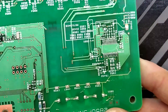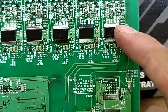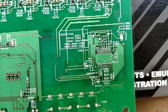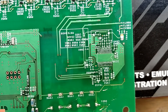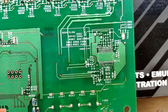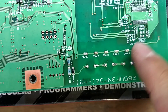This section here is completely not populated. From the pin-out it looks like it takes another one of these chips, so it was doing some kind of low voltage sensing at some point — maybe they had a current shunt instead of a Hall-effect current sensor, and they were reading it with another one of these chips, but I'm not sure what that was actually doing.